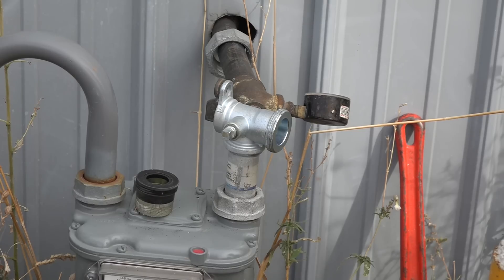The International Fuel Gas Code says you can test with as low as 3 pounds, depending on the size of the system. But we're looking for a leak here, so I'll probably start at about 5 pounds. Remember, on an older system that's been in for a while, you'll often find a whole bunch of leaks when you start putting higher pressure on it, so you may have to do some extra repairs.